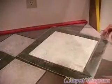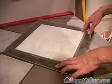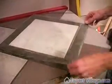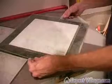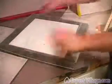So we made a 14 by 14 inch cutout in plexiglass that we can lay over this and center everything off of. Everything is off of these four sides right here — you work inward and get all of your spacing, and then you work outward to get all of your spacing. And that's how you would lay out an ornate or a diagonal countertop.